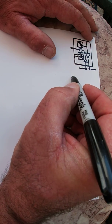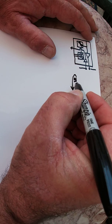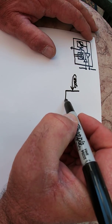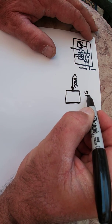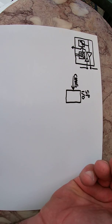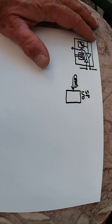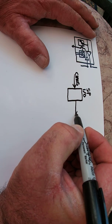That vTX, you're going to have coming in here some CMOS data off your camera. It's just digital video. So right away, you're going to have some kind of signal processing to get to the right logic levels. An I/O function, interface, input-output function. Even though it's digital data, you still may want to filter it, make it nice and clean and crisp. But coming out of there, what's going to happen next?